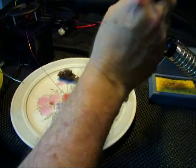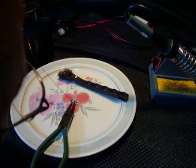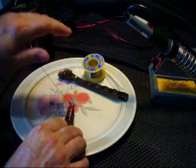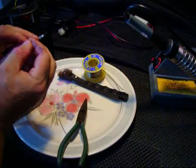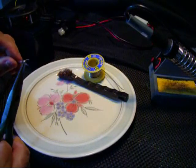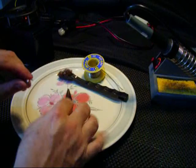Clean off my tip, put my soldering iron back, and let it cool just a little bit. Now, this work can get hot, so you have to be careful. It's a very small wire, but it's not hot, and it's got a nice little clump of solder down at the end. It's not a cold solder — although it looks a little bit like it, there are some shiny parts to it. It looks pretty good right there.